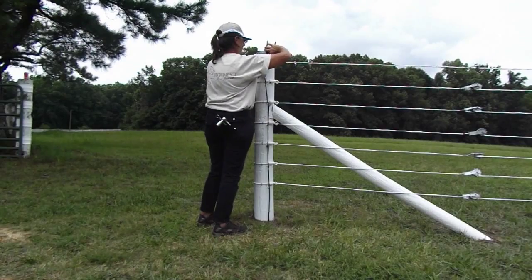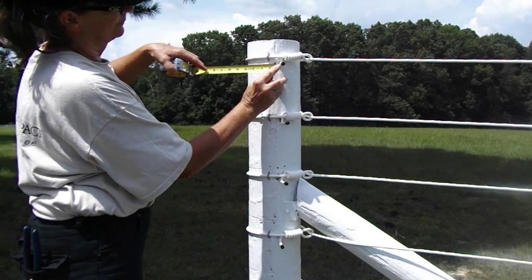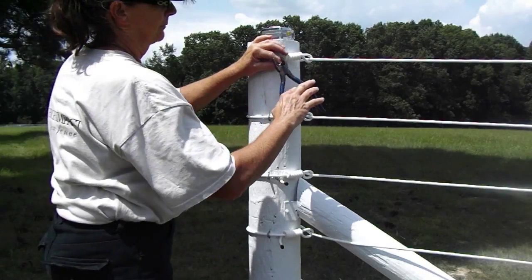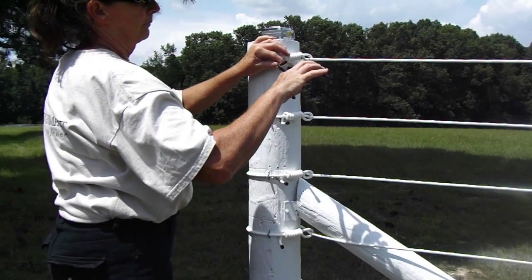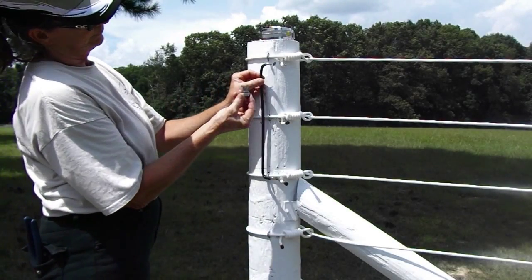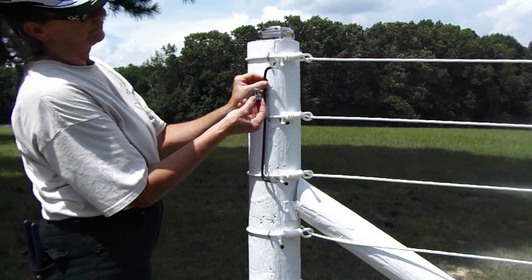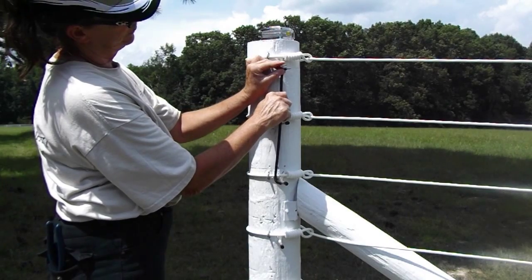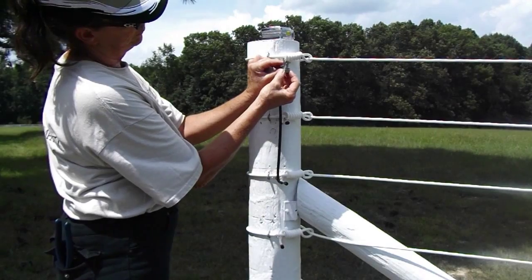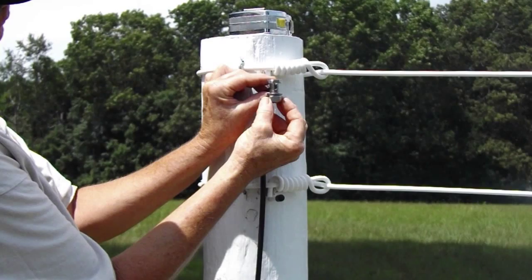Attaching the Shockline rails is easy. Measure three-quarters of an inch from the capped end of both end loops, and remove the polymer-coated Shockline rail along with the caps. For this next step, a pre-made jumper cable using underground cable is needed. Remove three-quarters of an inch of plastic off each end and bend each end 90 degrees in the same direction. Using a split bolt, join the jumper wire to the top section of the Shockline end loop where the cap was removed.